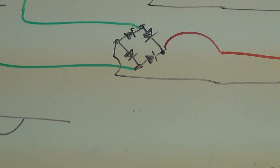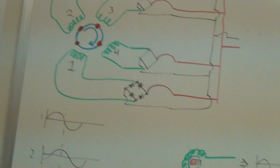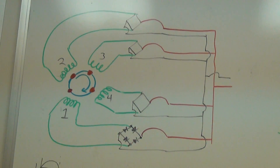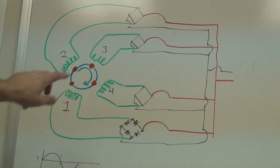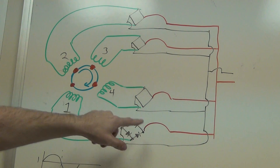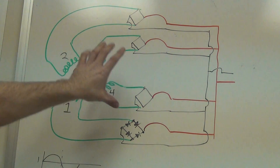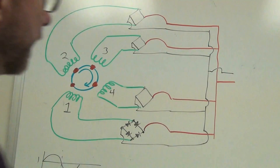What I'm going to be doing with mine is this craft up here. It looks complex, and I guess kind of it is, but it really isn't. You've got four magnets and four coils. Each one of them goes through what's called a rectifier. After you take all the rectifiers and you take all the voltage, you have just one positive, one negative lead out of it.